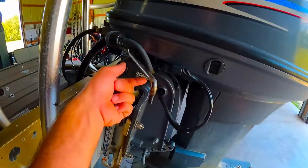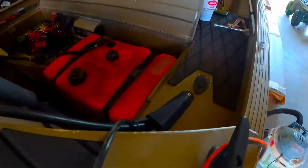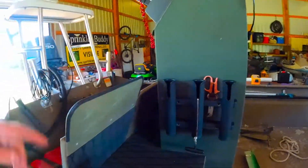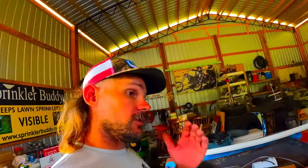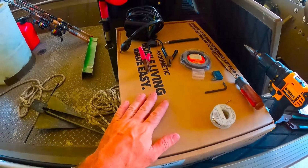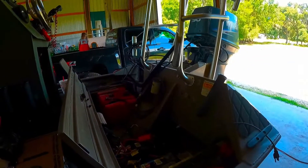Our steering cable popped, so we got that disconnected. We pulled our cable out here, so we're going to have to snake this through the boat. We pulled some covers off for the lines and we'll have to get up in there and disconnect from the helm, pull the cable out to run the new hydraulic steering which we had come in yesterday. So this will be exciting. We're going to go through this kit, show a little video of that disassembly, reassembly, the process. It's pretty straightforward - a lot of guys have already done this.